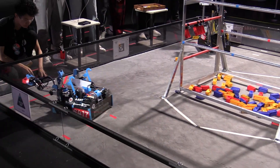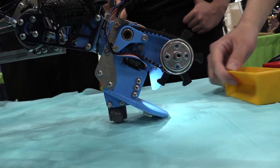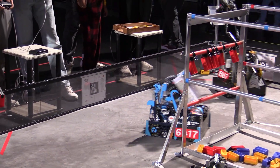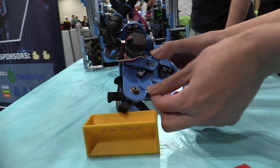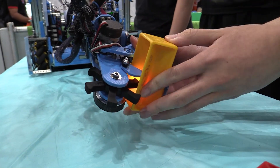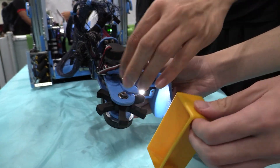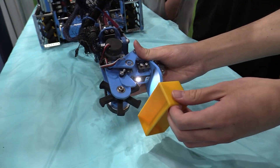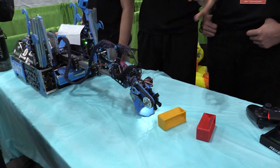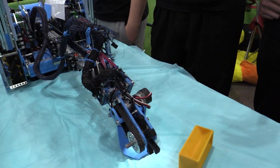At the beginning of the season we tried multiple intakes. We saw a lot of potential in an active intake for grabbing blocks from the submersible, but we also needed a claw to score specimens because you need downward force, and it makes depositing samples easier with more control. So we combined the two: a bootwheel for active intaking and a clamp that acts as a claw to keep the block in for specimen scoring. We also use it for samples because it gives a much firmer grip and the block flies out a lot less.